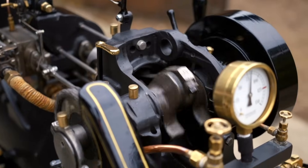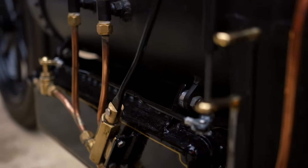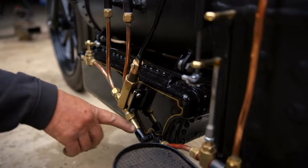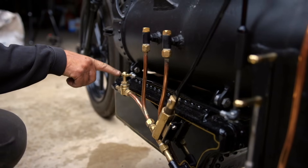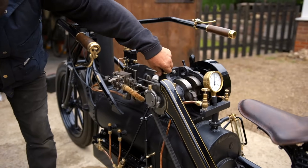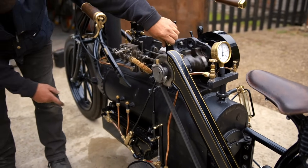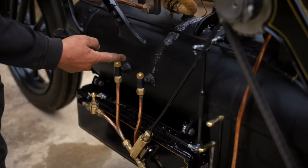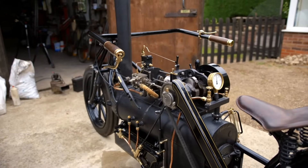What's the little pump at the bottom doing? We've got a pump on the end of the crankshaft — this eccentric here is moving that rod up and down, which is moving that pump. The tank is full of water, and it's pumping water from the bottom of the tank up to the top all the time. If I turn this valve the other way, it shuts it off and you can see it sends water up this pipe straight into the boiler, filling the boiler with water. That's the feed pump.